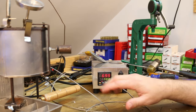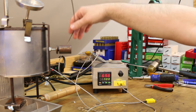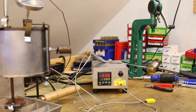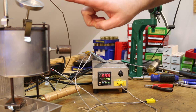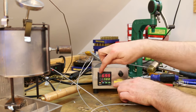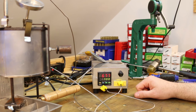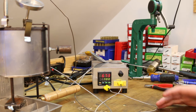We are up to temp — I've let it sit and stabilize. Currently on the old thermocouple dancing right around 700. I also pulled out my Lyman thermometer and it reads a little hotter than the PID, sitting at about 730. So the big question — let's disconnect this thermocouple at 700 and connect the other one. It reads 675 — so 25 degrees lower. Let's write this first observation down: 25 degrees.